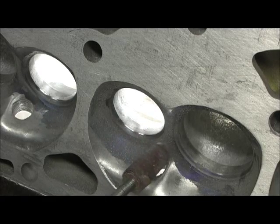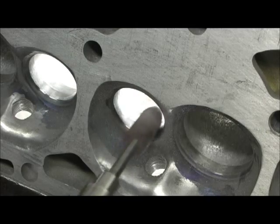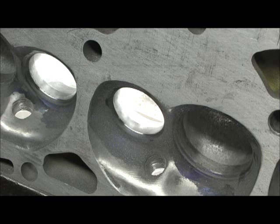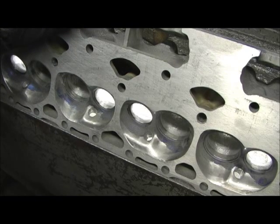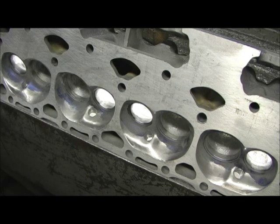This is part two on the exhaust as far as polishing with the 50 grit. I'm trying to give Mr. Kish a little bit of a bargain here. He's been pretty patient waiting for me. I had a couple of things come up right in the middle of doing three or four pairs of heads and I'm just now getting back on track, so I'm giving everybody a little bit extra bonus. Usually I only go to 50 grit on a lot of the exhaust — I don't do anything because it really doesn't help that much. But cosmetically speaking, it sure makes them look good. The only real benefit is it keeps carbon from building up. I just wanted to show you how I roll that. I go all the way around on the intake and the exhaust and break that little edge so it's not so sharp. It's attention to that kind of detail that really does the trick.